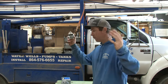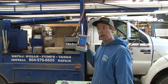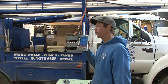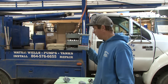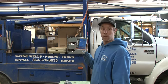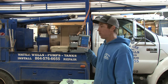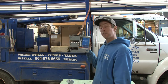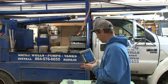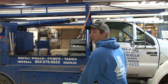So now you're asking: if you don't like that, what do you prefer? This is my option of choice if you're worried about having low pressure or running out of water — Pump Tech Plus. We've done a video on these before, going to put that also up at the top of the video for you to click on. This is my idea of a low pressure switch. It doesn't kick out on pressure — it kicks out on water. So it senses amp draw, and if the water gets down to the suction of the pump, the amp draw is going to drop way down because your pump's not loaded up. It's going to kick your pump off versus a mechanical means like this.